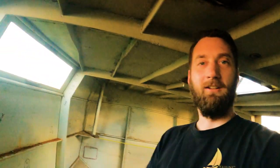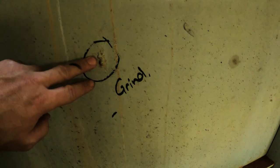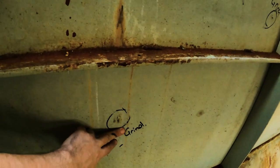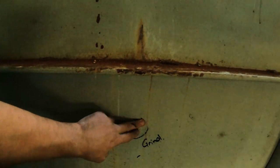I'm just here in the aft cabin, and since I'm going to be spending a bit of time doing a lot of work in here getting it all prepped, I've gone and identified a lot of what I want to get done. I've been identifying where they tried striking an arc or maybe welded something on to pull these panels into shape before welding. I've identified all these spots to be ground off. I was writing 'grind' everywhere, so I swapped it and just wrote G because it was faster and more efficient.